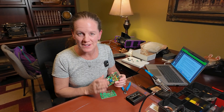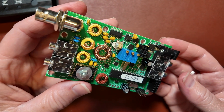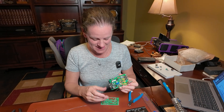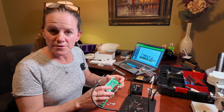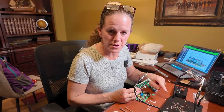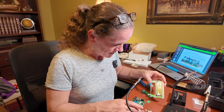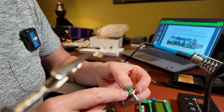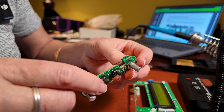I've got the main PCB board completely done — the power, sound, adapters, antenna connections, and more toroids, which weren't even kind of as hard as that first one. Lots of parts, and it's done. I put the display on, and when it tells you in the very beginning to keep those little extra wires, pay attention, because you need 16 of them to connect the two boards together. I've put the buttons on with extra soldering because the length of the wires isn't quite right, so lots of detail work. But if you're patient, you can do it.